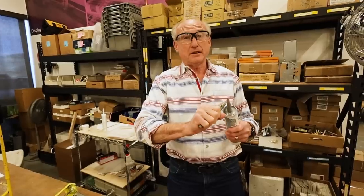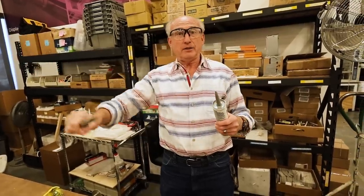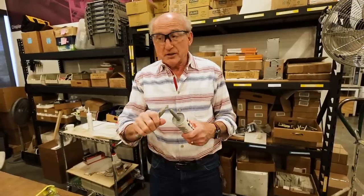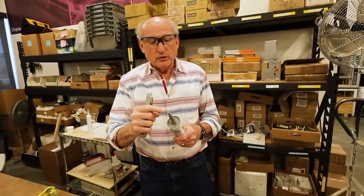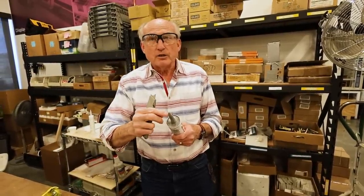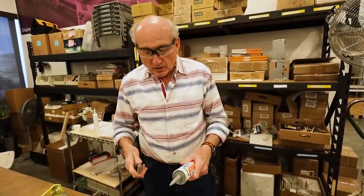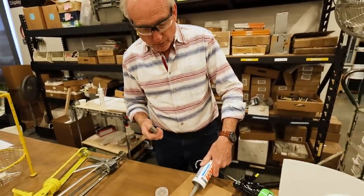Now, what we see on the job site, and sometimes we've seen this at our own plant, is people cutting a nozzle and flailing it like we're cutting a fish open. This is not exactly how you want to do it, because that's kind of dangerous. If you don't get a smooth cut here, you're dragging that little nub through the caulking and you're not going to get a good looking bead. Great point. So always put it down on a firm surface.